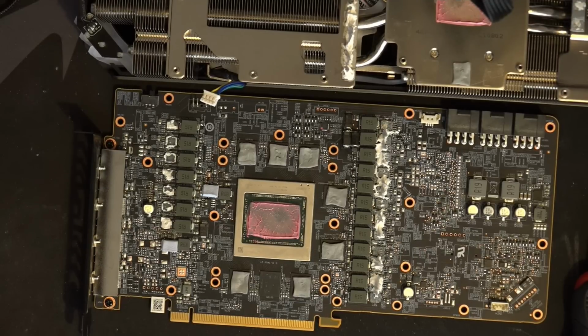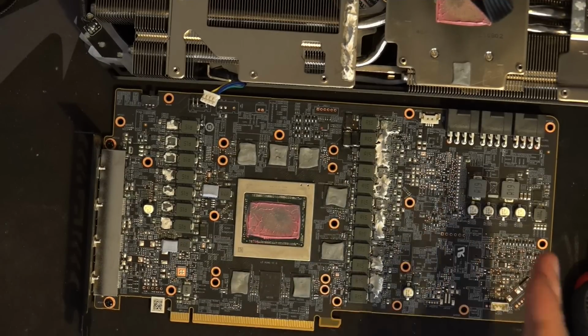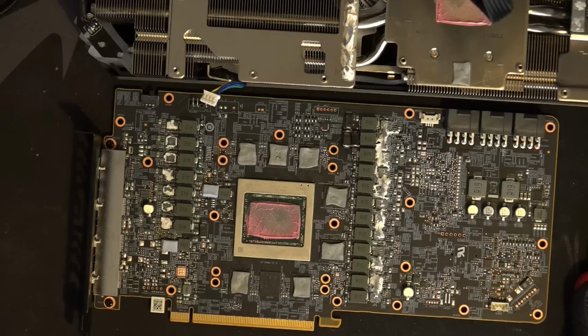I'm starting to wonder if it was really noisy because every time the card went through a transient, the input voltage would dip so hard that the output couldn't do anything about it, if there's no energy to pull in from the input side, right? And I can't believe this is a thing on an 1800 quid card